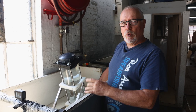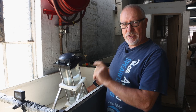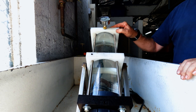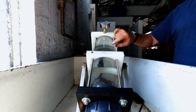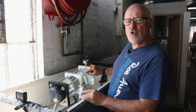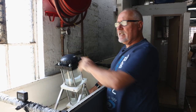This is not a design we've developed — this is just something we've manufactured here following similar smaller designs, mainly for watches. It's how they do pressure testing on dive watches. At the moment we've built this, clamped it together, O-rings everywhere. It's a very strong tube that can handle I think six bar. We're going to operate it around two bar, equivalent to 20 meters.